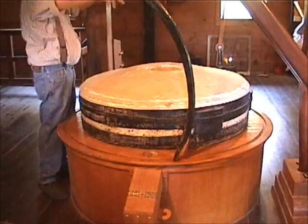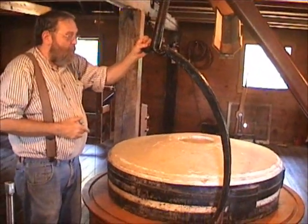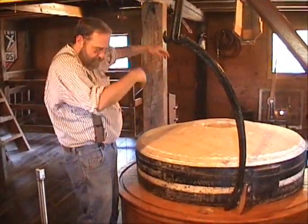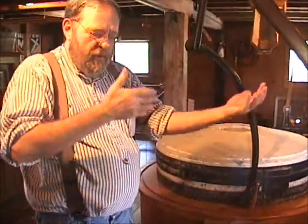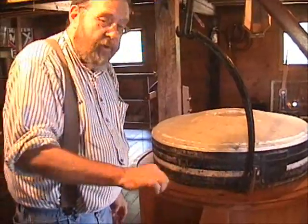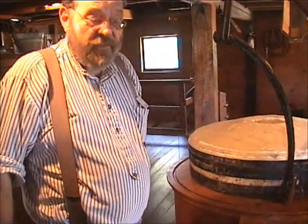The sections lift up and then this floor slides back so you can have access. The big knuckle part — you need to lift it about nine inches and swing it out. We have six-by-sixes; you build a stack. As you bring it out, you flip it over, set it on the stack. You can stand next to it and clean it. You start with a scrub brush and a sweeper, an air gun, a dental pick — whatever you think you need.